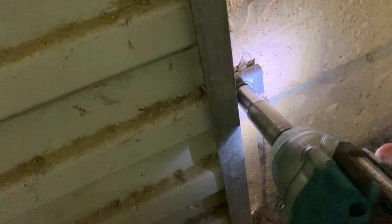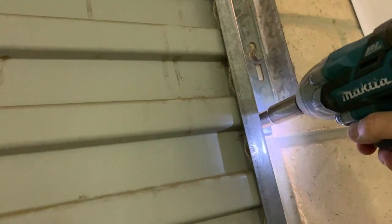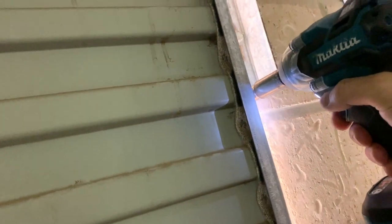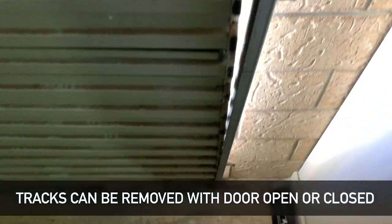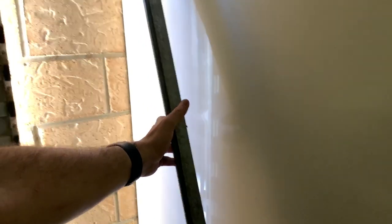In this instance I have 13 millimeter coach bolts in plastic plugs into a brick wall, so I'm using a 13 millimeter long socket with my Makita impact driver. You might have tech screws, timber screws, or dyna bolts. If your track is welded to the post — good luck! The tracks can be removed with the door closed or open. It is a bit easier to do it with the door open as you don't have as much curtain inside the track, but either way is fine.